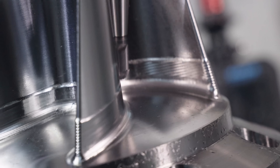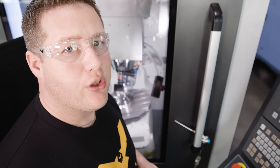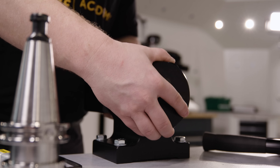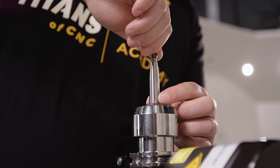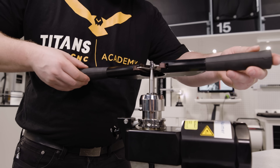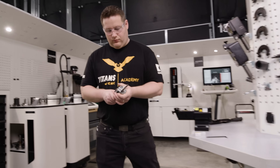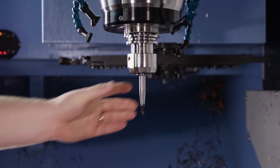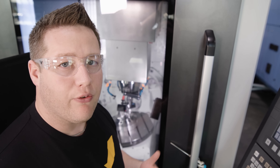So by sticking the tool out a little farther, I'm able to keep the contact point as high on the ball as I can, which is allowing all four flutes to be effective and giving me an even, consistent surface footage throughout the entire cut — at least until it gets to the bottom of the fillet where it transitions to the bottom of the ball. But it's going to be for a short period of time, so we should be okay. Since we're using a 3/8 ball nose and the tool is sticking out so far, to help keep the tool as rigid as possible, we chose to go with Kennametal's Duo-Lock system. We're only using the ball portion of the tool, so we don't need a long length of cut. With the Duo-Lock system, we're able to get a larger diameter shank with a smaller tip on the bottom. This particular one has a half inch shank, but we could have gone with a 5/8 or even a 3/4. You can get them with a straight shank so you can cut them down to whatever length you need, or with a safe lock feature to keep them from pulling out of the holder if you're doing a roughing operation.